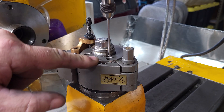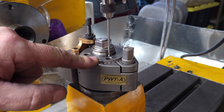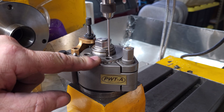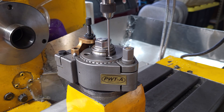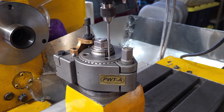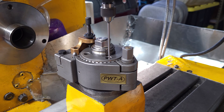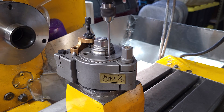I'm going to try to use the wiggler to find the center of this hole. If I had gauge pins I would use gauge pins, but I don't, so we'll see how this goes. We're running about 600 rpm and I've already eyeballed it to approximate center. I sped this part up - we're using the wiggler to touch off on either side, zero on one side, go to the other side to get the kickoff, then hit the half button on the MPG. I should have gone back and done the X after the Y, then the X again, but I neglected to do that - it worked out okay though.